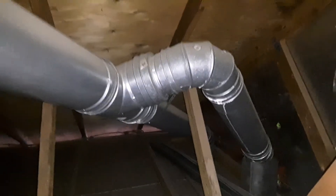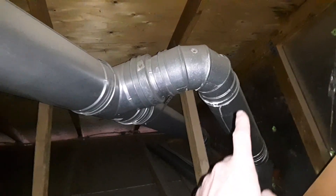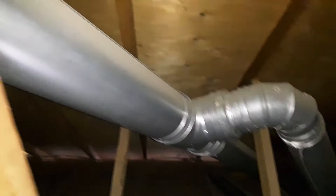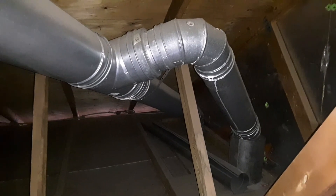You can't have them both in the same liner. You'll also notice it's got an improper slope and pitch — it's got to go downward. Your exhaust pipe should always be on an incline going up. So you have two issues going on here with this furnace installation.